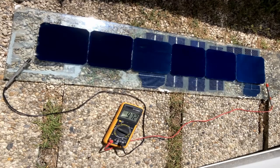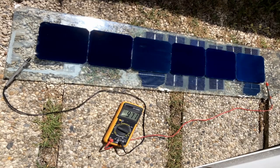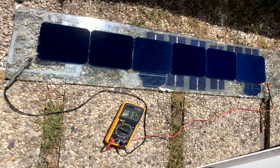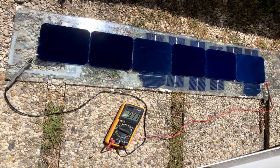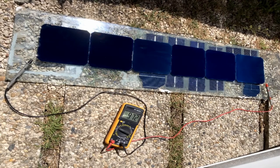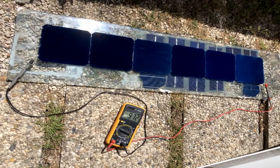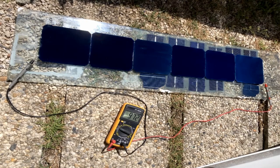Now you are seeing a string of our Gen5 solar cells. Before the encapsulation, we made a tryout to check their amperage under the Sun. Here we are in August, that means summer in the North Hemisphere. We are in the middle of the day in order to catch the best points in time for this test. As you can see here, it has 9.71 A in short circuit. We consider it a good value.